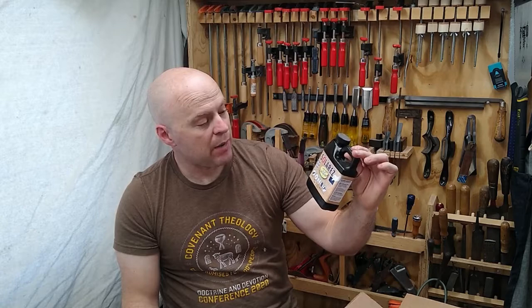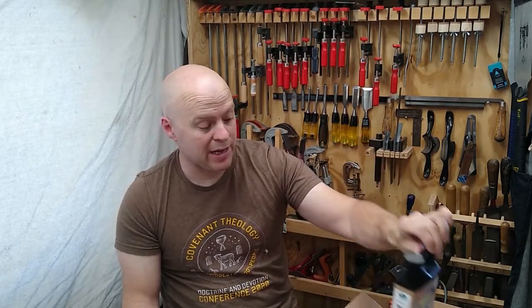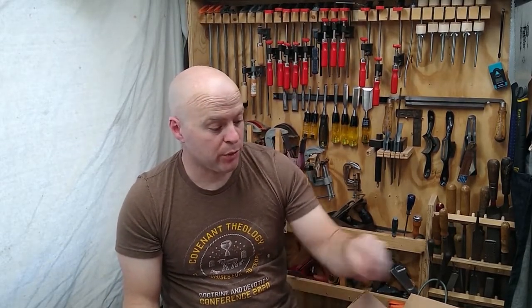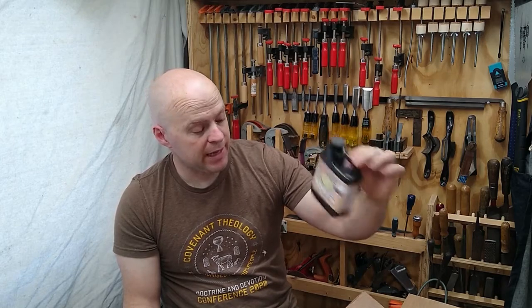I'm not sure how I'm going to film all this, but the grain sealer, you kind of squeegee on and you squeegee off as much as possible and then cure it. And then I'm going to do that about 4 to 5 times, maybe 4 times on the whole body, and then maybe 1 or 2 more additional coats on the roundovers and the edges, because those are where we tend to burn through. I want more thickness there. So we're going to grain fill all that end grain as much as we possibly can.